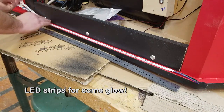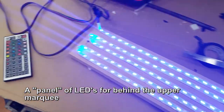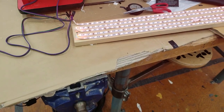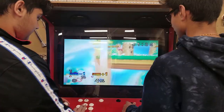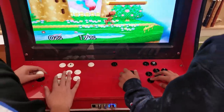I was originally going to put backlighting on this arcade, but I found that those strips behind it just didn't look cool, so we only did the LED panel behind the upper marquee. I basically just glue-gunned that thing down to a piece of MDF, which I mounted behind the artwork. I got this on Amazon, and it came with a remote controller. There's an IR receiver that is just below the monitor — there's a small hole there.